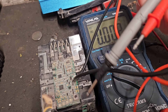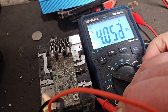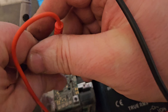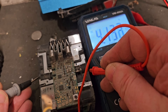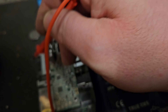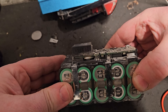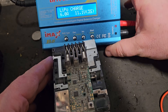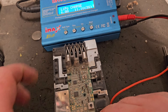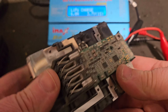Let's get the meter here and have a good look. Number one is 4.05, number two is 4.08 — near enough. Number three is 4.13, a bit high. I might need to bring the first two up in line with that and then do this one. So I'll balance them all up to the highest one. I'll just go for the two end cells again — the middle one seems to have come up higher. So just balance again — put that on there. Now the cells are fairly well balanced.